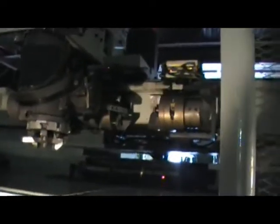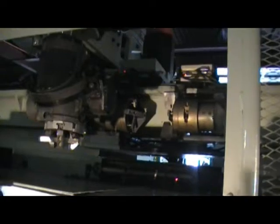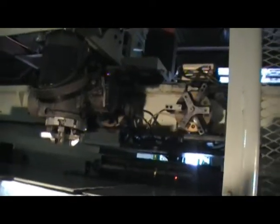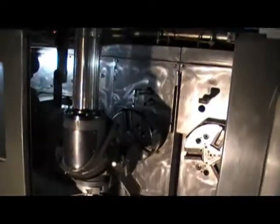A very nice option on this machine — you can see those two tracks in the background. You can actually switch your parts from front side to back side automatically. You don't have to flip the part manually or leave it on the stacker table; the machine will flip it automatically for you. All those values are pre-programmed in the control itself. Right now it drops the part and goes back to the beginning of the cycle.